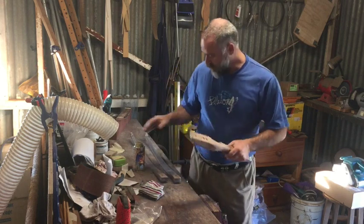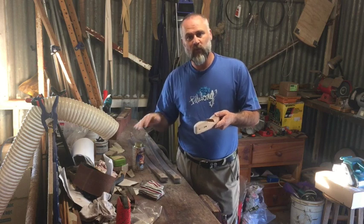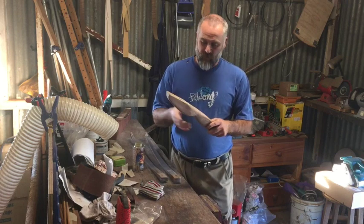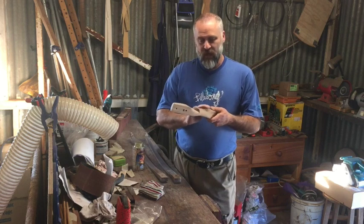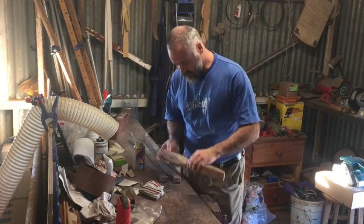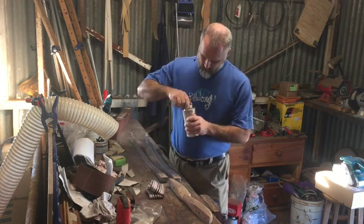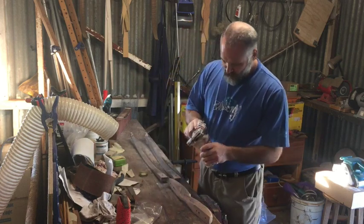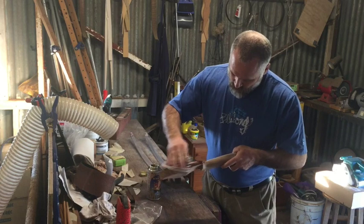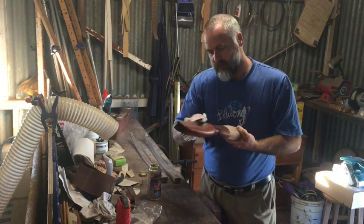What I'm going to do now is polish the bow with some oil. I usually put about three or four coats on each bow — I'll coat it with one layer of oil, let it soak in overnight, come back and put another coat, and keep going for about four coats. This is where you really see all the hardwood come out when you start to oil it — you see all those beautiful colours coming through. I'm using just a soft cloth with a little oil on it; all you do is wipe it on and make sure you cover all surfaces evenly.